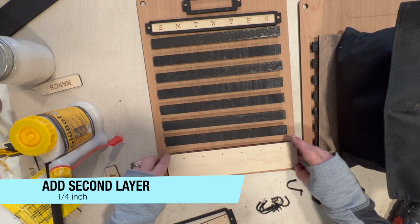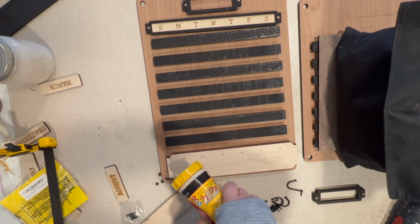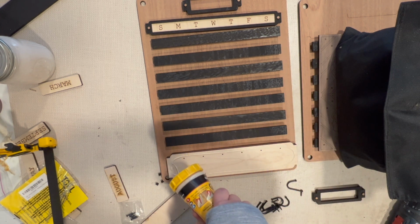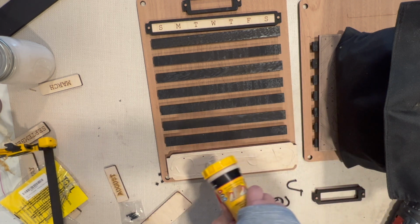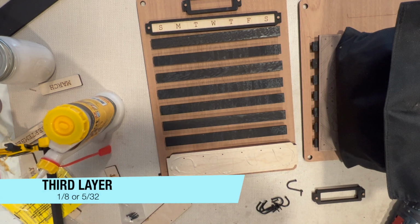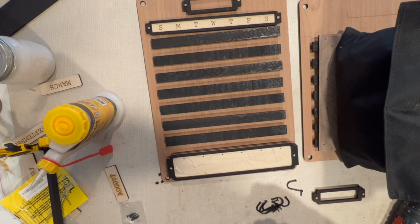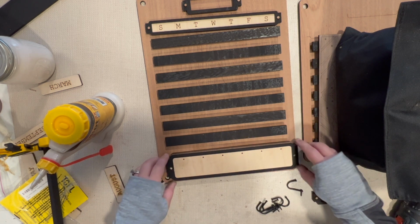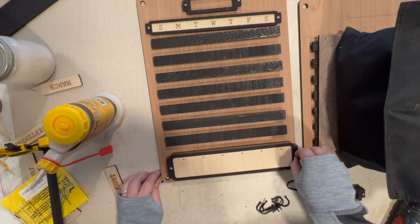And of course my wood has warped a little bit. So we're going to have to weigh stuff down once it's all glued down. I don't mind getting the glue in the holes of the screws. That's not really a big deal. You'll see I have little pilot holes. They are 0.07 inches. It's just so that you don't strip out any screws when you screw through all the layers. Plop that on top. Make sure they're all lined up. Go ahead and add your pegs since you've already got glue in there ready to go.